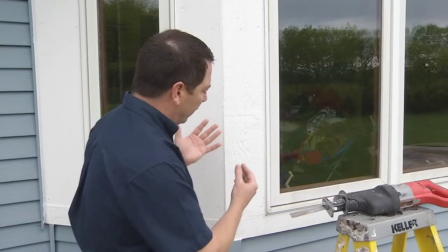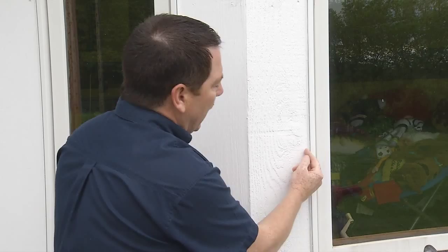One of the things we need to know about windows on the installation — the technique that the windows are installed from the outside of the house — is whether or not the windows utilize a nailing fin. A nailing fin is an L-shaped flange behind the frame of the window that goes in about a half inch to three quarters of an inch, then flanges out to the left, bottom, top, and right side all the way around the window perimeter. Nailing fins generally have pre-drilled holes or slots so installers can nail or screw the window into the framing from the outside of the home.